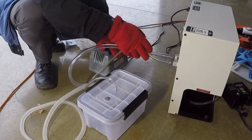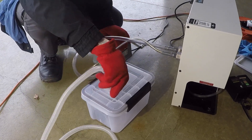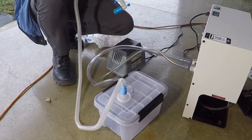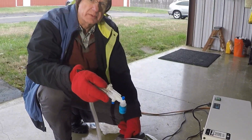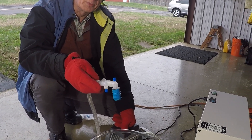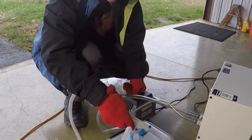So air comes into the pump, blows through the dehydrator, then through this box for historical reasons — you can cut that out if you like — and then my anesthetic tube plugs in here through a hole made with a Forstner bit. The five-micron filter filters out any silica dust or debris, and then this goes into the oil filler hole. I leave it on a timer from Home Depot, set for evenings when moisture tends to accumulate as the hangar temperature drops, and again in the morning.